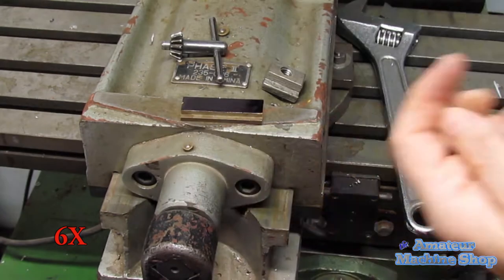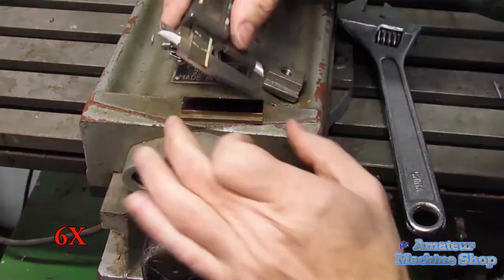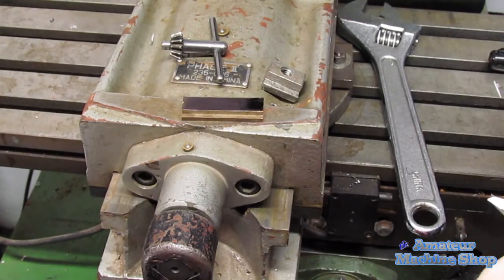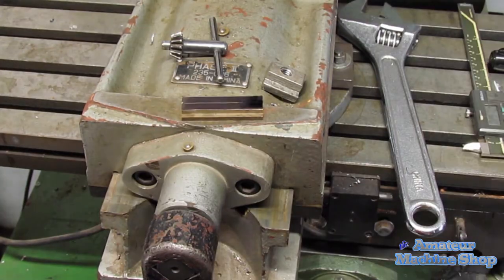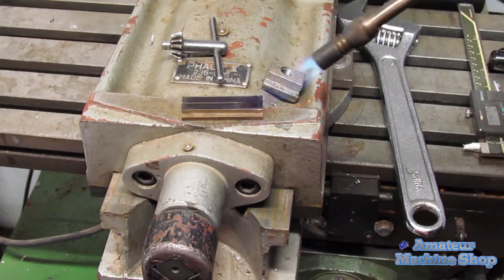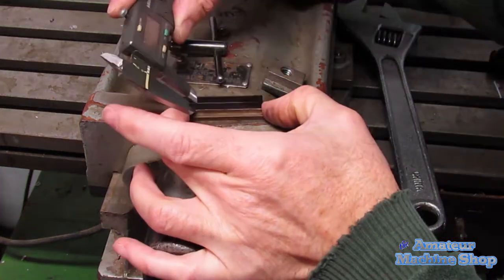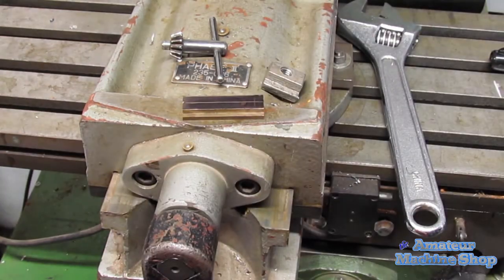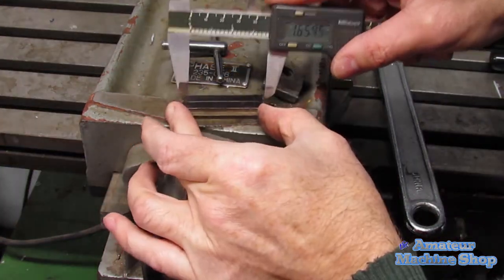Before I start milling and drilling, the holes in the outside periphery need to be scribed for reference. I didn't have a small center punch, so I ground the shank of a broken 1/4 inch tap to a sharp point and used it to punch the centers for each hole. For scribing, the points of the calipers are being used in the initial layout followed by dividers. The dividers didn't work so well, as this set doesn't lock.